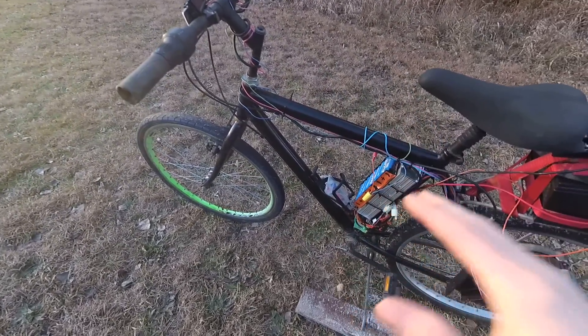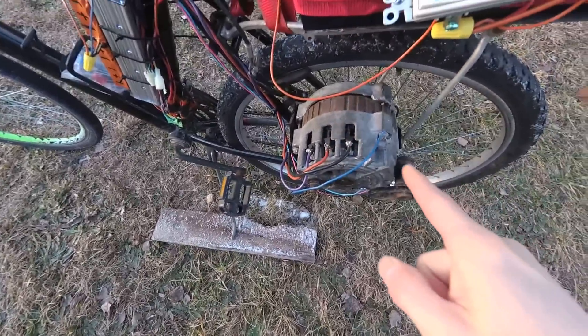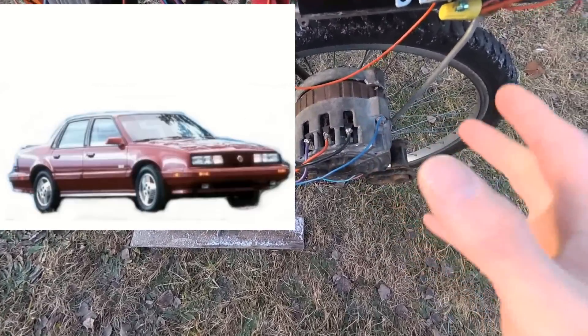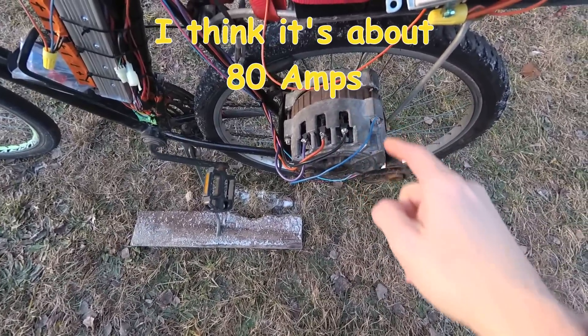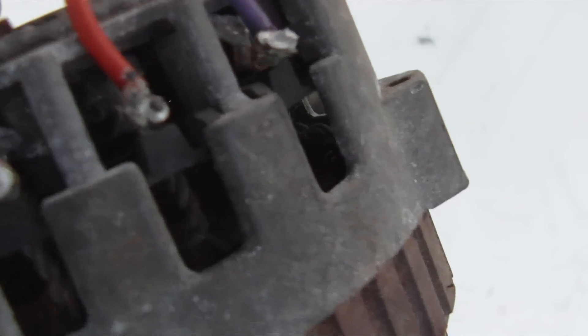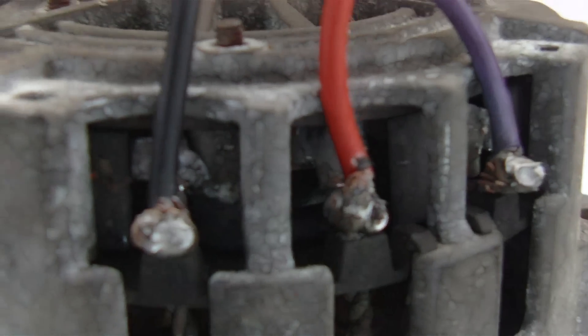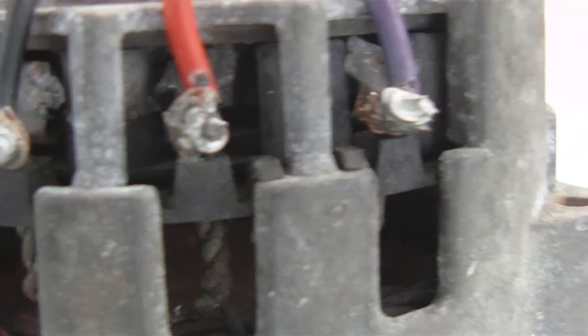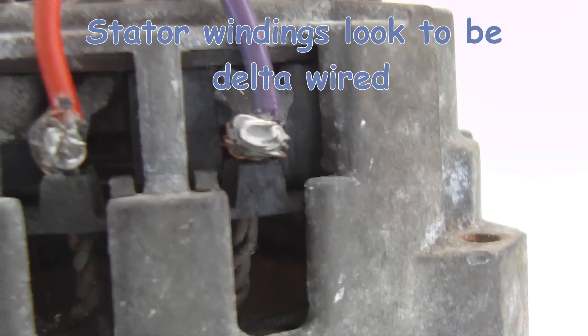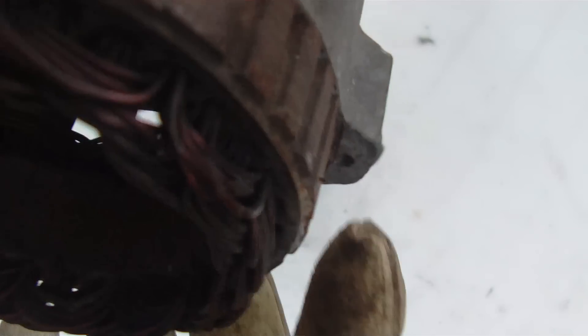So what are all the parts here to make the alternator bike function? Of course we'll start with the alternator — this was out of a 90s GM car, and I have a bunch of these alternators around. This one was very easy to convert. To convert the alternator to a motor, basically you're disconnecting the stator windings from the bridge rectifier — as you can see they're disconnected from the coils and the wires are directly soldered to the coil, so there's no more connection to the DC.